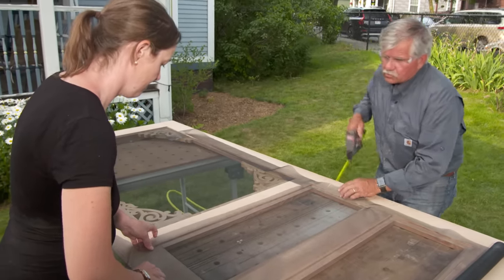Here's your door, Laura. I oversized the door a little bit both in width and height because it's an old house — you don't know if it's settled and if the opening is racked at all. So first I'll put it tight to the opening on one side and fit it, marking a little bit to take off each side. Once it's fit that way, I put it back into the opening and cut off the bottom and top so it fits if there's any angle. We tip the saw about three or four degrees so when you rip the door down it'll be beveled and that inside edge won't hit the casing as it closes.